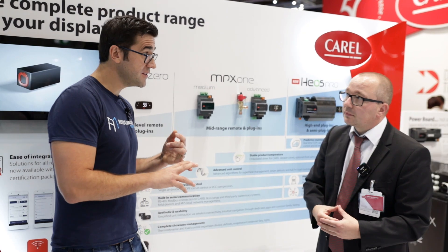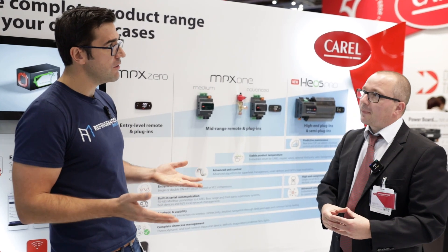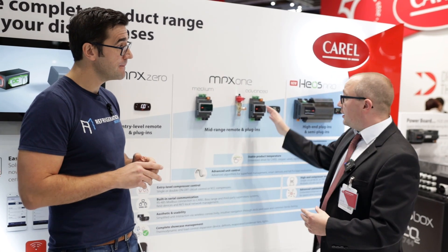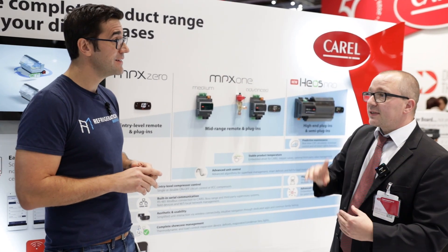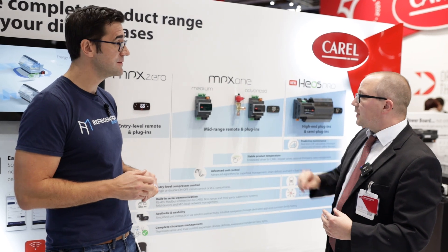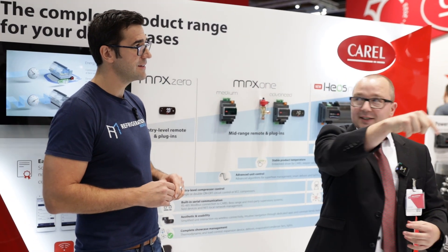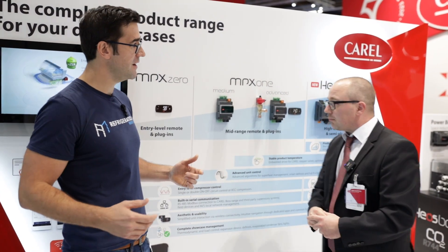Can it shut lights off? Can it raise the suction pressure if you wanted to? Suction pressure and superheat raising is also something possible, but for that we need something more to manage it — and that's something we would see in a couple of minutes on the outside of this panel.